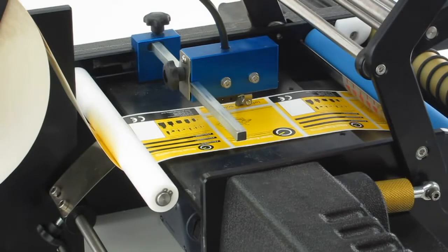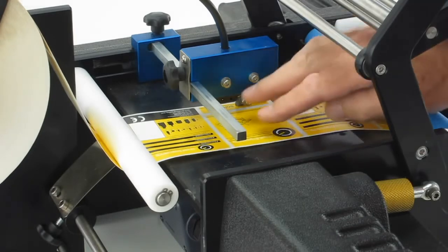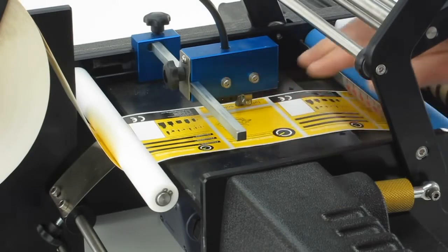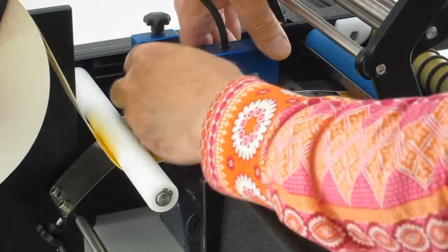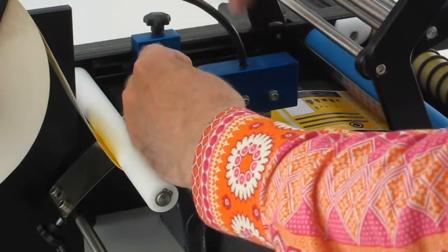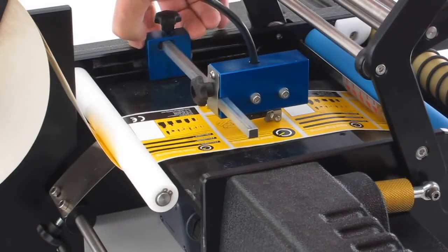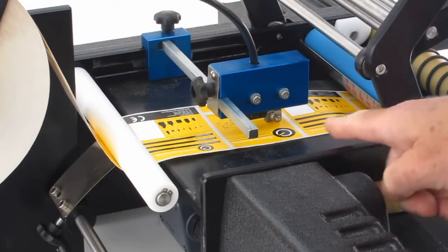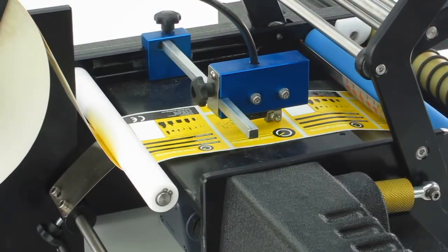The sensor tells the machine when to stop feeding your label. We've got our front label here about to come out onto the bottle. We have a back label here and another front label here. It's important to be in sequence — front label to front label, or back label. Bring the sensor across the machine to the label, approximately four to five millimeters from the edge of the label, and sit the sensor width on.